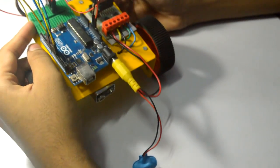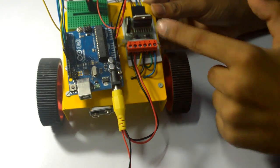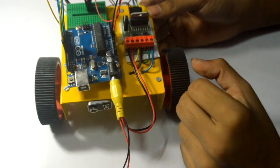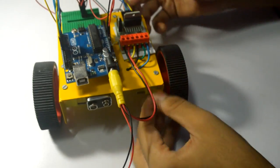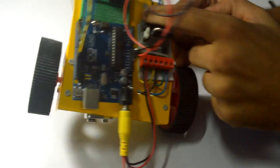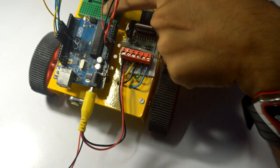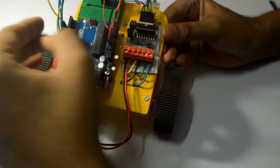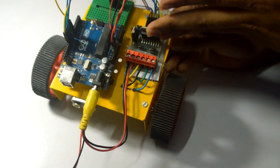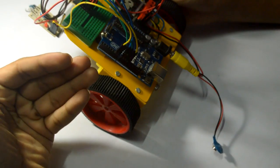Let's repeat the whole circuit. The main power source is routed to the DC jack and to the motor driver IC L298N, which handles voltage and current for the motors. There are four motor outputs and four data inputs to the motor driver IC. Everything logic-related is drawn from the 5 volt rail on the Arduino. I've made two extra rails using the mini breadboard. Pins 8 to 11 are the four motor output data pins from the Arduino going to the motor driver IC. Left sensor is on pin 6, right sensor on pin 7 — no PWM needed, just a high or low.